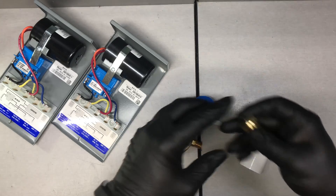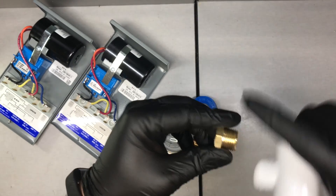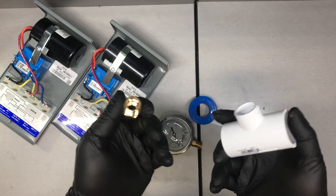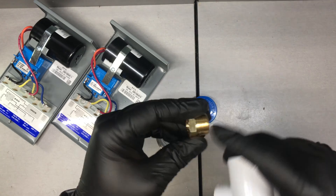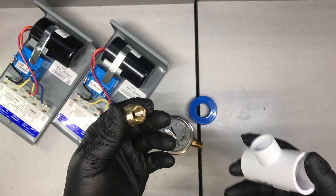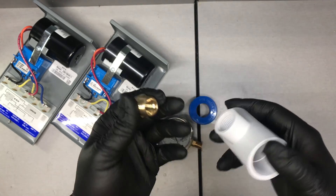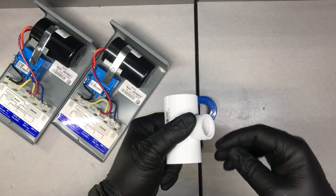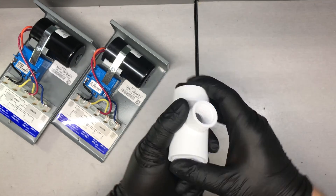There are a couple of different ways you can seal these threads inside of these pipes. One way — kind of the hack way — is to just coat it with a bunch of PVC cement and then thread it together. But that's not going to do much over time because as that PVC gets brittle and pressurized, the metal is not going to break down at the same rate. That stuff is really designed to create a pipe weld and it's not made for metal to plastic. So over time you're going to create leaks. The next thing you can do is use what's called plumber's dope, which is like a Teflon paste that you put on the threads and then thread it together.